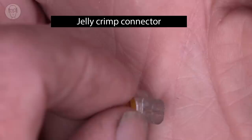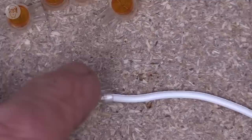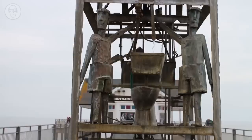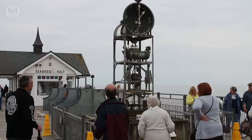Another sort of punch-down connector, widely used by telephone engineers for joining wires outside, is a waterproof connector called a gel connector. The two wires go in the two holes at the end, and the gel makes the connection waterproof. It takes both single strand and multi strand wire. Push both wires in and punch it down — the two wires are firmly connected and waterproof. I used to use these on the water clock for some of the switches and sensors, but eventually redid them so there weren't any connections outside in boxes, because it is particularly severe out on the sea.